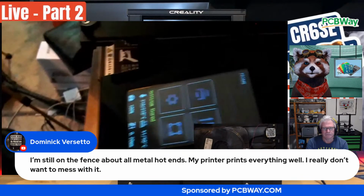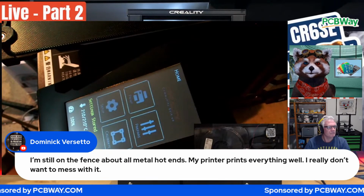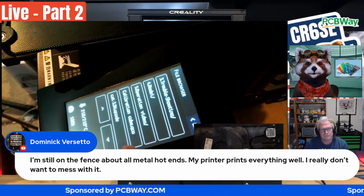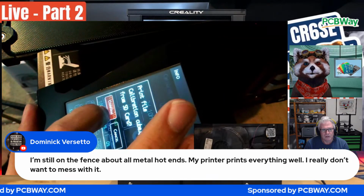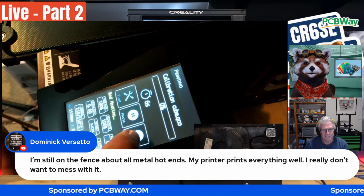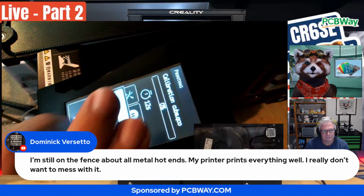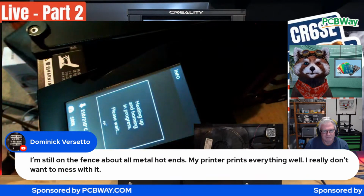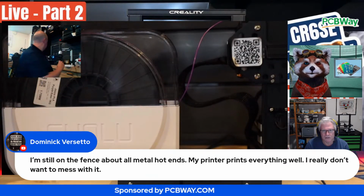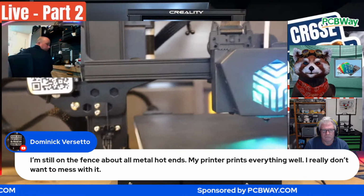All right, so let's see if plugging in the card does anything. Ah, there we go. 210. Nope, I'm not going to use that. And so that is at 80. Yeah, turn that down. 260. Turn that down. And you're at 210 degrees still on the hot end. Is that a bit hot? Yeah, I've got to increase it a little bit more. I can't do it right now because it's probing.